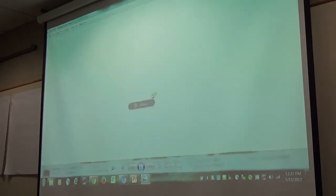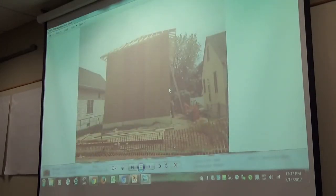The end of, let's say, framing, we should be here. Short of maybe having some openings or windows cut out, right? But this is basically the box stood, all the framing done, and now it's ready for roof deck framing or sheathing. And then the next step would be, because they're independent of each other, can happen at the same time as roofing, and then the installation of the membrane. Okay?